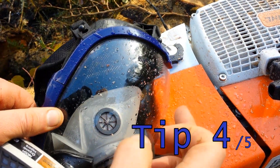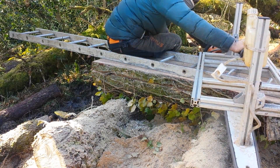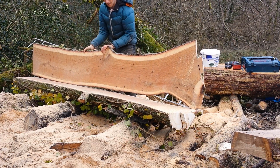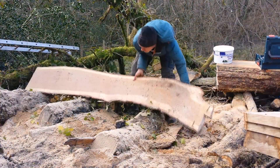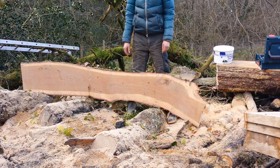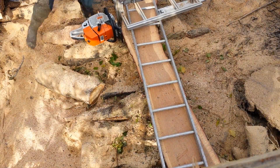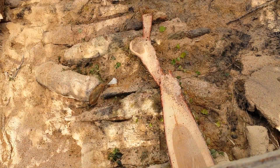Tip four is about refuelling between cuts. It's important to check the fuel level between each cut, but also with these caps I've noticed lots of people tend to fill both the fuel and the oil right to the top. Not only does that mean you're much more likely to have an overflow and have fluids go everywhere, but it also makes for unhappy seals — as you're compressing them shut there's no spare room to compress. I've found that tends to really reduce the life of the seals and you're much more likely to end up with oil and petrol leaks around that area. One cool thing about chainsaw mills is that you can get boards out of these half-round bits normally if you want to. It does often take a little bit of rejigging so that the saw clears whatever the half-round is resting on, but it means you can stack it with the rest rather than having an awkward half-round bit left over, which is a bit wasteful.